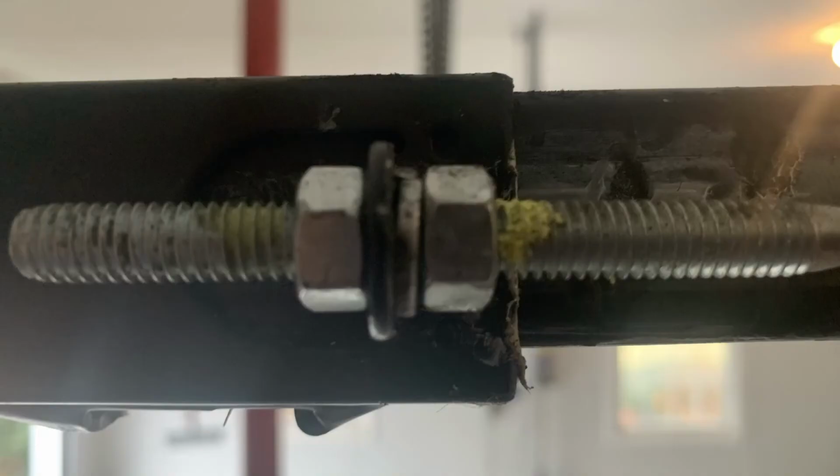Tighten your chain tensioner. You don't want to overtighten it. You want your chain about halfway between the bar, about a half inch from the top, but you definitely don't want to overtighten it. You don't want an overtightened chain because that will break your assembly, but you don't want it too loose either. If anything, I would err on just slightly slack. We did mark our chain tensioner, but there's a good chance you are going to need to make some adjustments to this once everything's back together, because the way the chain fits on the sprocket doesn't always go in the exact same holes it did before.